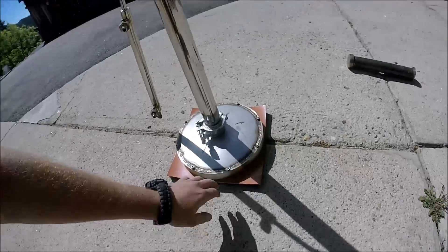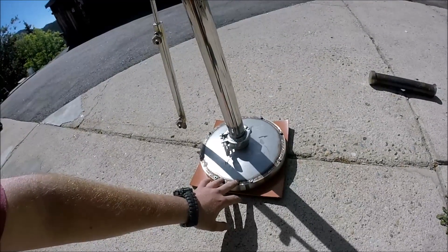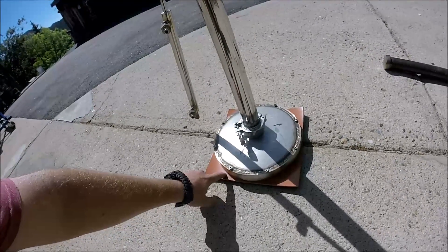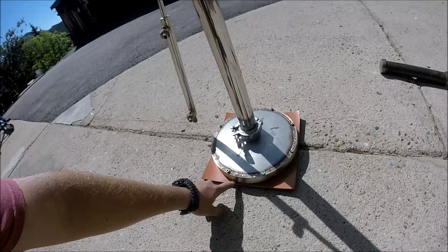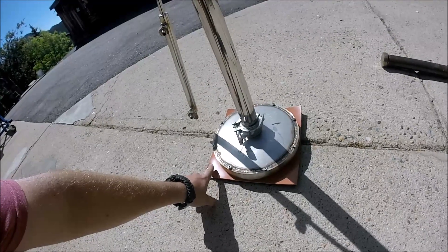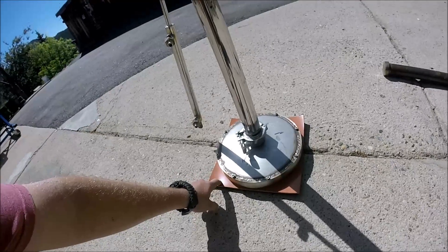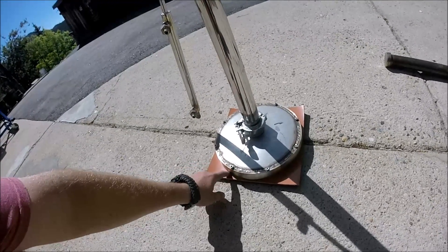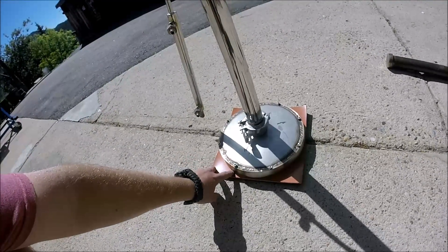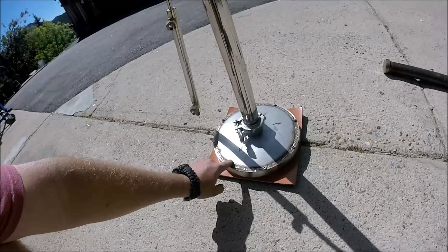The problem with this one was I was trying to make a large wide base on the primary tank. Unfortunately it's really hard to maintain a seal around a large diameter — that turned out to be its downfall. Even though I have some really expensive RTV silicone rubber, I tried to seal it with that and unfortunately it leaks out through small pores whenever you heat it up, no matter how much I clamp it down.